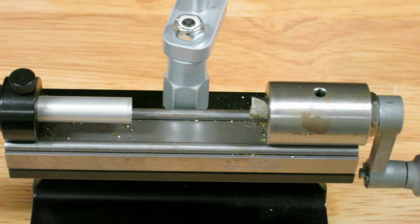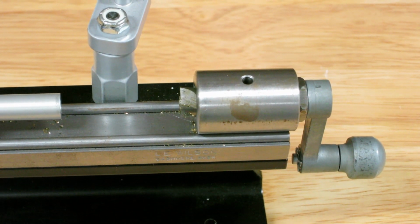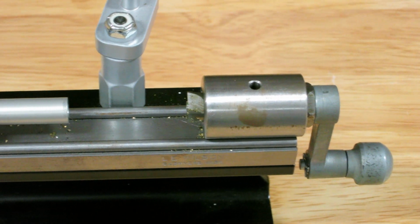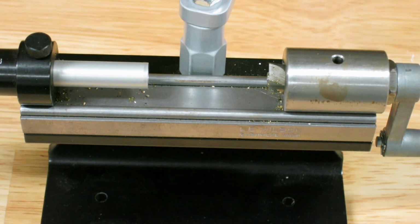And then as you make it all the way to the right, you see the cutter itself. It's essentially a custom end mill which is mounted with a hand crank and then rides in a steel body. Sinclair's version also adds the black aluminum base with two mounting holes which allows you to secure it to the bench.